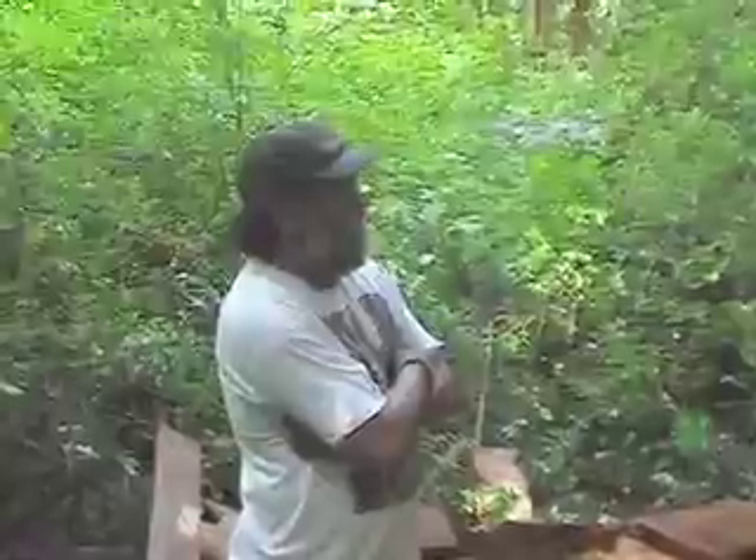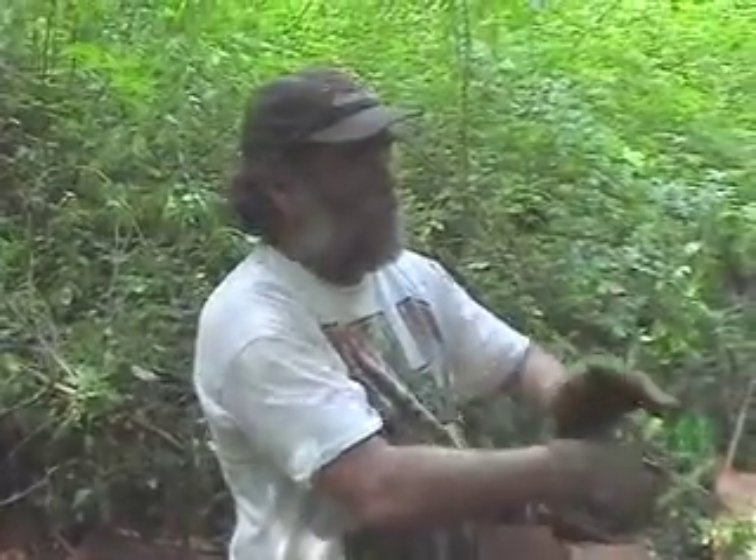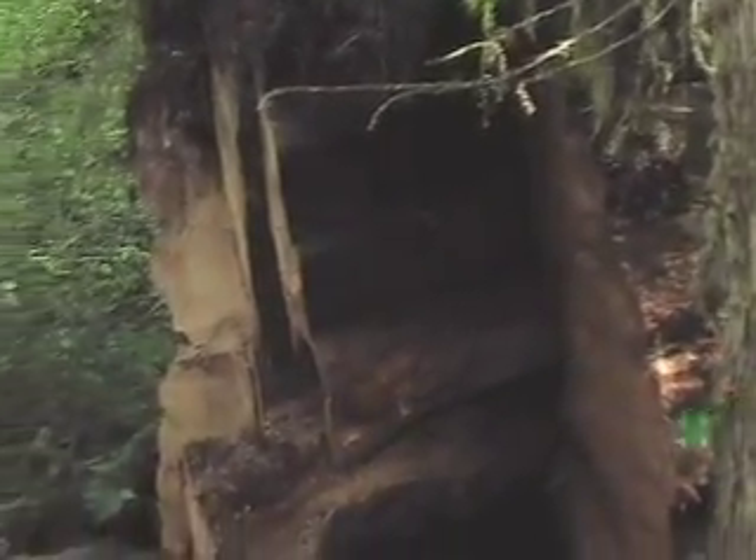Do you think you'll be able to salvage most of what's usable here for shingles? There'll still be a root wad because I won't be able to go much farther than that cut there. I might get one more cut and then I'll be done. The bark seams - the farther you get down in there, the more rot and more bark seams you get. And that's a bug hole - that's where the bug's been at it. This is where the tree folded and the bark was in there and the tree got bigger and bigger.